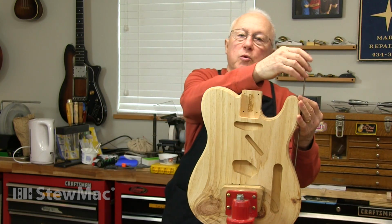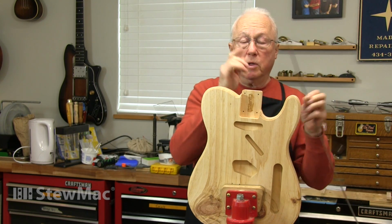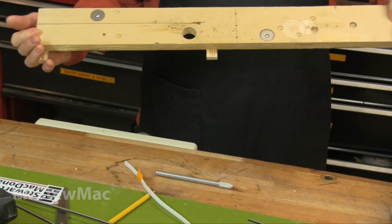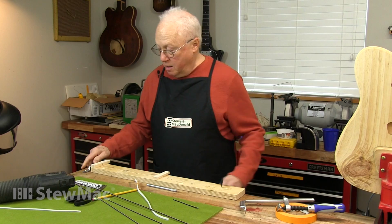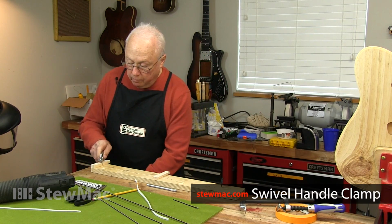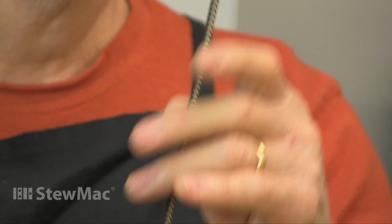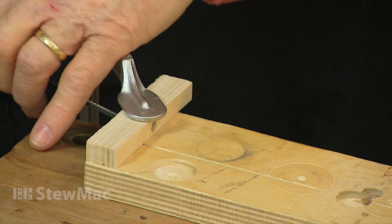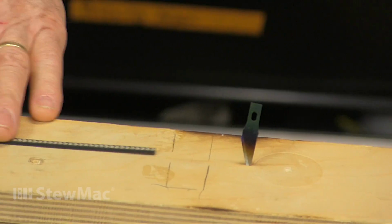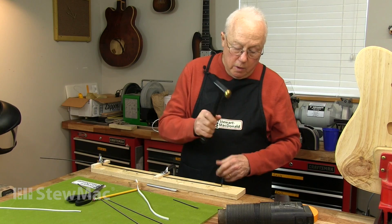I still had trouble doing it. It was hard for me to separate it when I got up here. So I came up with a little tip to show you how to do it. Got a scrap piece of plywood here that's done many different jobs. I'm going to clamp it down to the table. I've got my herringbone going this direction. And these are my little guide holes in this block of wood, super glued to a board. I get down to this X-Acto blade that I hammered into the board.